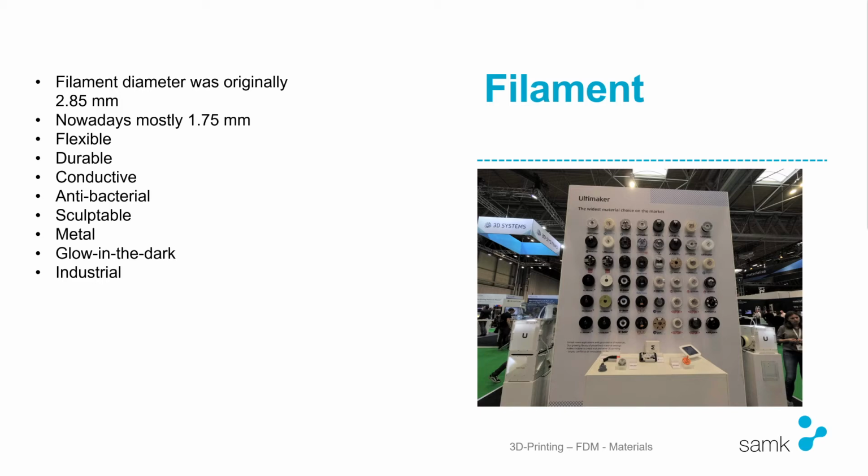And then another reason is that some Bowden type 3D printers work a lot better with the 2.85 millimeter than the 1.75 millimeter diameter material. And that's about it. I mean, just a few reasons. And okay, maybe some flexible materials might be a bit more usable in the 2.85 millimeter diameter than the smaller one. But those are basically the major reasons. Some manufacturers don't just want to transition just yet. And some printer manufacturers, more the industrial printer manufacturers, still use the bigger diameter materials.